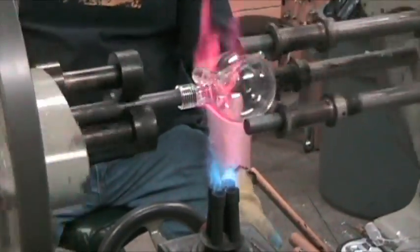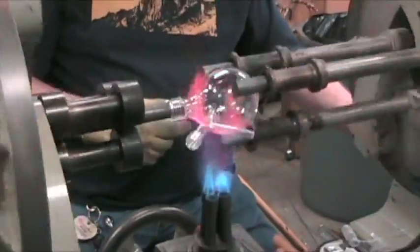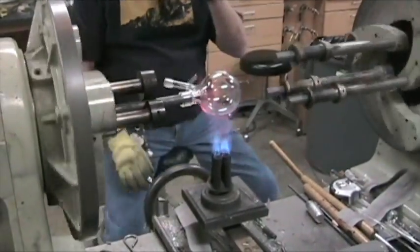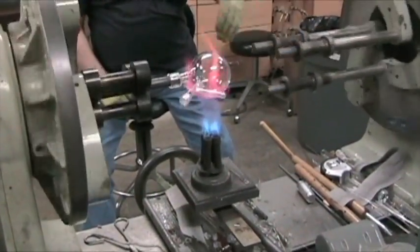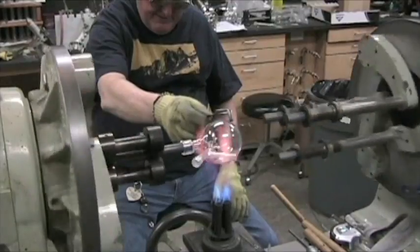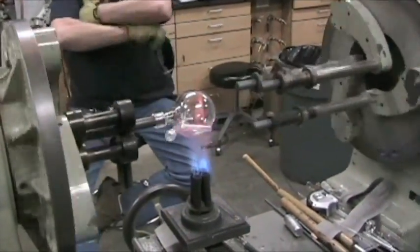It's all starting to stay the same color now. See how there's a lot of orange on this side over here and very little orange on this side. In a little bit it'll all equalize. Right now there's a stress band that's traveling through the glass right in about this area here. This side is not projecting any orange sodium out — it is on this side. This side is warming up, this side is not quite yet. But watch the flame grow and equalize the whole piece.